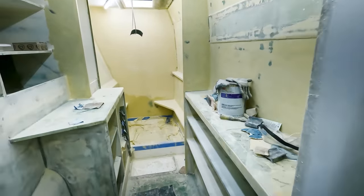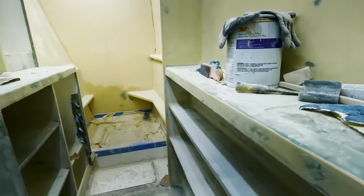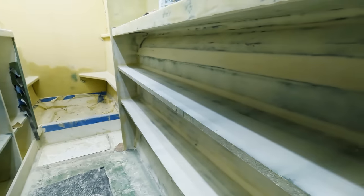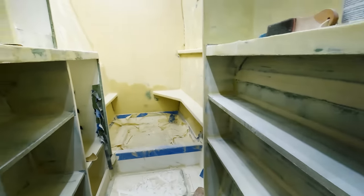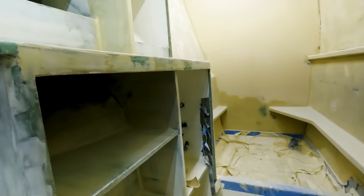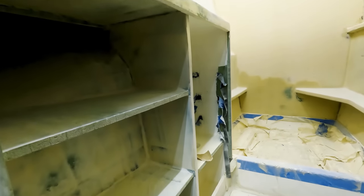And since I will have some of that primer already mixed up, I'm going to go through and just do these cabinets in the head, like a little outboard space here that's been done practically forever, as well as the space here where our sink is going to sit and extra storage. Those are things I've been working with way too long because I get into little hiccups with the polyester fairing compound, especially as we're getting back into the heat. And now that I work with the epoxy fairing compound, I've realized that it's much easier because it's a little bit thicker, which personally I find better for those little minute spots.